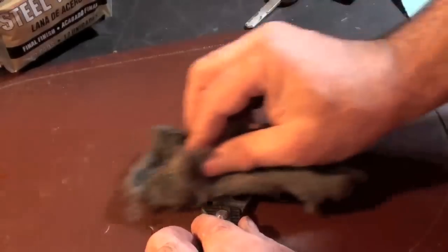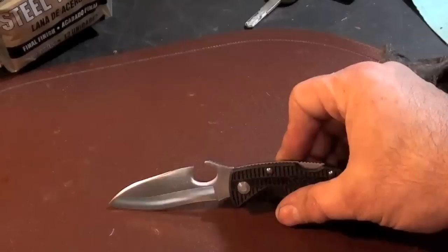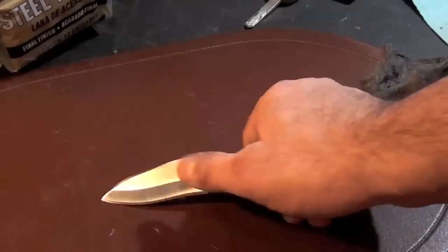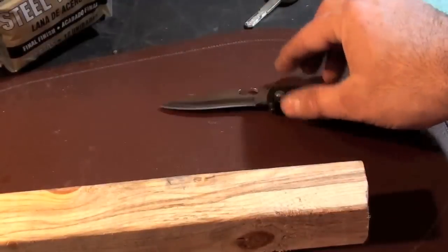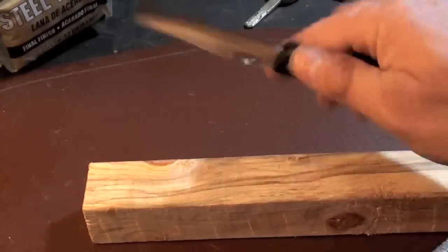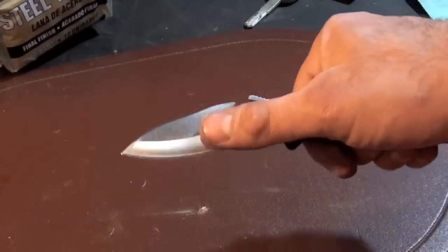That's what this knife had out of the box — sort of a brush look to it. I think we've got a perfect looking knife. I'm happy with it now. Little things bug me. The reason I shined it a little bit and then brushed it back is because when I had this up on the drill press on the piece of wood and was pressing down on it, I put some scratches in there and that drove me crazy. So what you might want to do, if you try to replicate what I'm doing, is use a piece of felt or something that doesn't scratch the side of your blade while you're working on it on the drill press. There it is — it's perfect. I'm very happy with it.